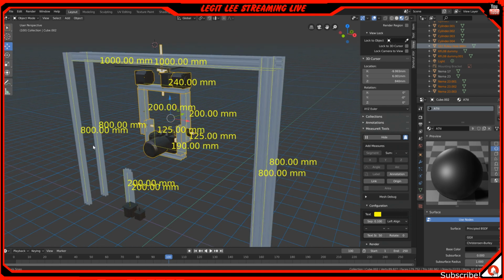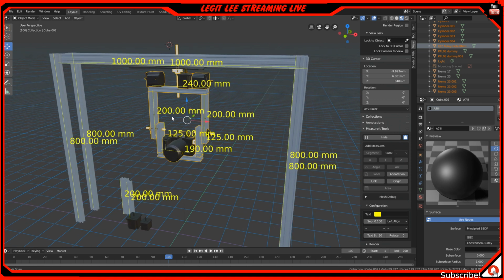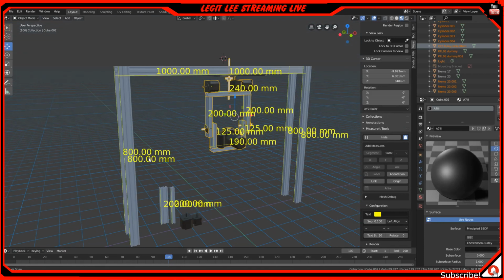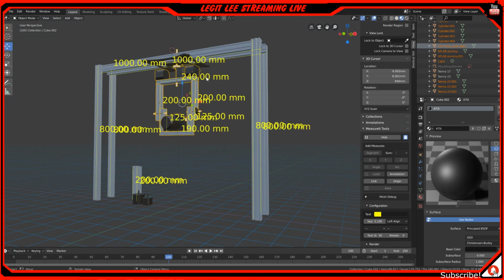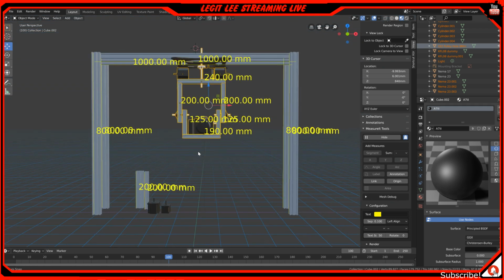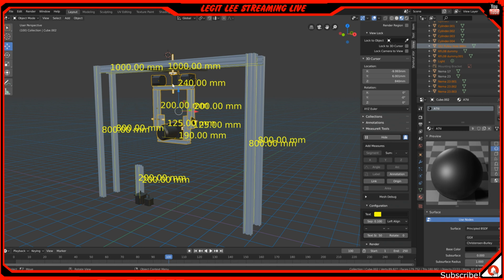And if you think about it, that's in a complete box here. So we have 700 for the travel, and then we have 1,000 millimeters from here to here to the ends. So we're probably cutting off about 80 because there's 40 on each side. So you have about 920 worth of space to be moved, depending on where I put the end stop. So 900 to 920, give or take, of travel from left to right. So up and down is about 700, and 900 basically for left and right. And then for the pan and tilt, you have 160 degrees worth of travel. I forgot to tell you that.